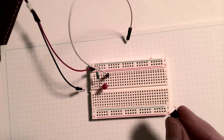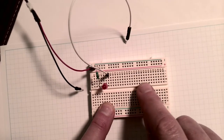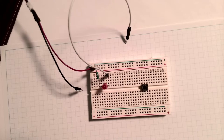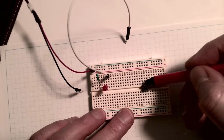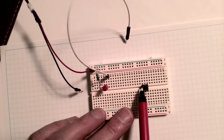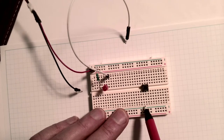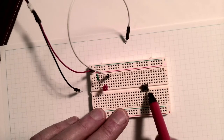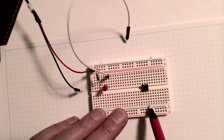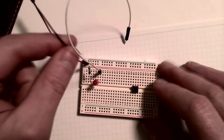It's a little bit hard to see, but I'm going to take that and do the grab across the trough that runs down the middle of the breadboard. So what that means is that all the holes on this row here, column 21, are connected to that leg of the switch. Column 23 at the top is connected to the top right leg. The bottom left leg is connected to column 21 on the bottom of the breadboard on the other side of the trench, so it's not connected to that one. And the bottom right leg of the switch is connected to column 23. So this allows us to test the various possibilities for connecting up the switch.